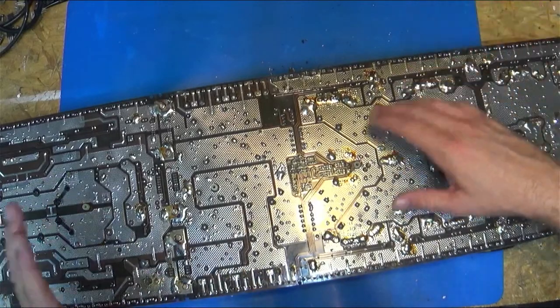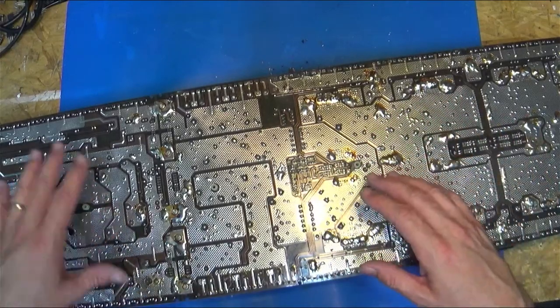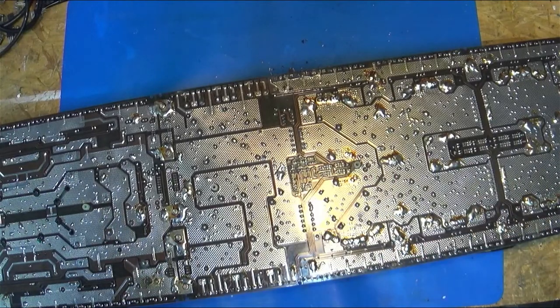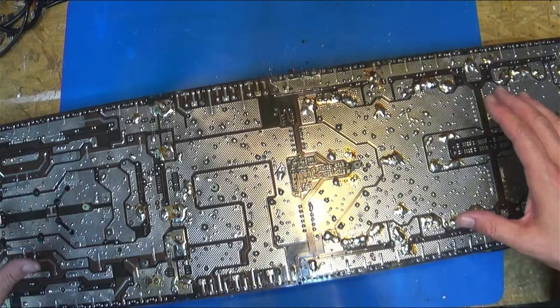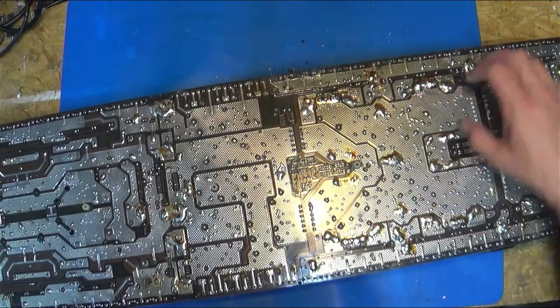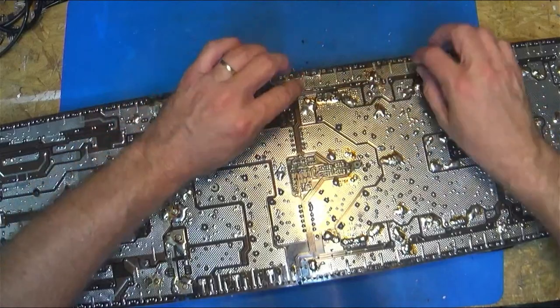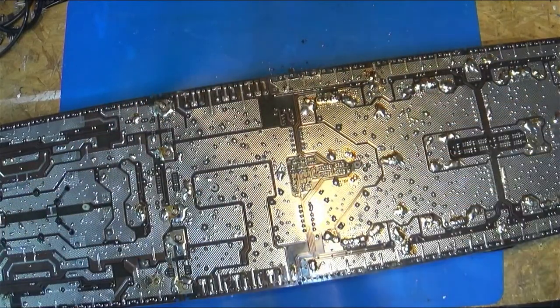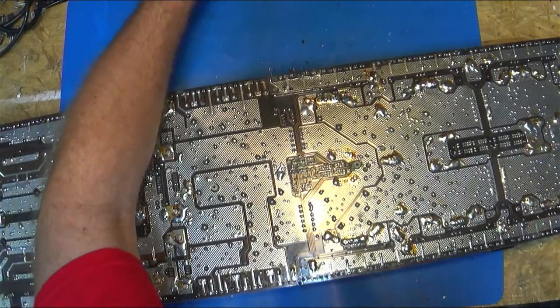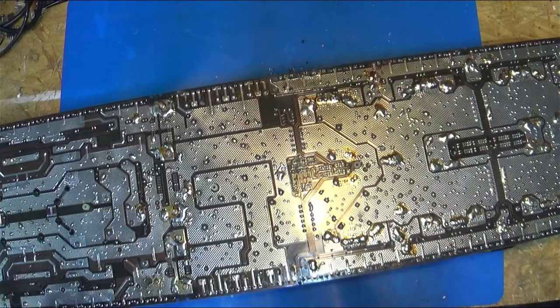There's guys that do this for a living. And so they've got these boards that they've got in, and they quoted it because it was really burnt up or whatever. And the customer said, no way, keep it. I'm just going to get a different amp, and I don't care. And so they've got these old blown boards that they can go in and actually cut chunks out of that were good. So say if I had another one of these that was all blown up here, but I could get this nice little section, I could Dremel this out, put it back in there, and then fix all the traces and stuff and reconnect those wires with jumpers, and then reconformal coat it and replace that section of the board with a known good section. Like I said, I know Jason, he does that for Phoenix Golds, and he's actually made his own custom boards that are designed to go in a certain spot and repair a known bad area of the board.